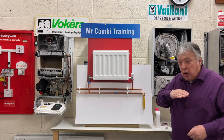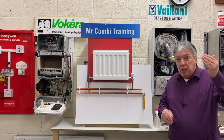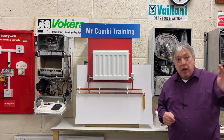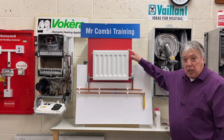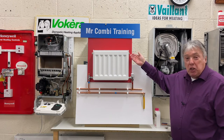So all of the low ones that we drain down from come first, and then we go upstairs, and then we go from the furthest one from where we pulled in the inhibitor and slowly vent that, and then we gradually work all the way back to the highest radiator furthest away, and we let the air out, and all we need there is a little bit of kitchen roll or toilet paper and the key.